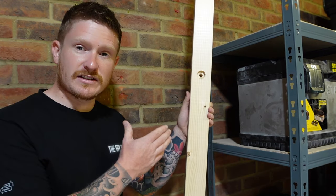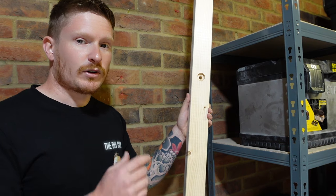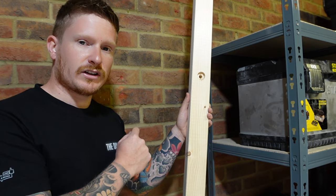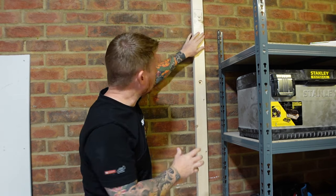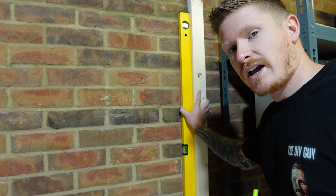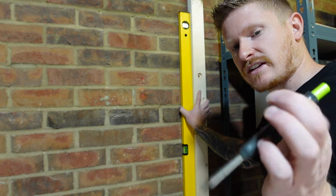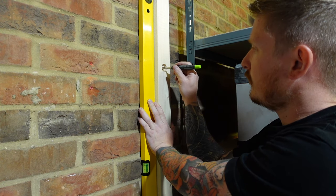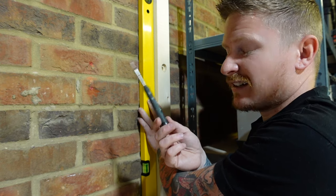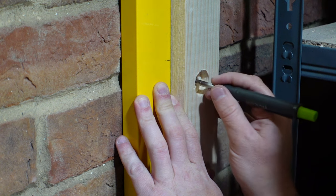Once the timber is prepared, place it against the brickwork or concrete, level it up, put it in its final position, and mark onto the brickwork where the fixing points need to be. Bring it away from the wall to drill the holes — there are some simple techniques to make this a lot easier. Place your piece of timber where it needs to go, grab a level to make sure it's in the perfect position, and once you're happy, I'd recommend a tracer pencil. They have a nice thin end with an extendable lead so you can make a mark all the way through the hole to know exactly where to drill. They're really handy, really cheap, and last for months.